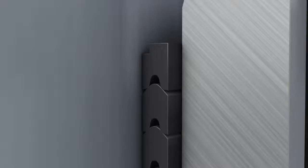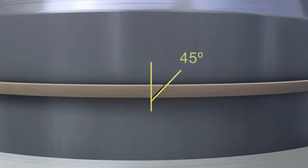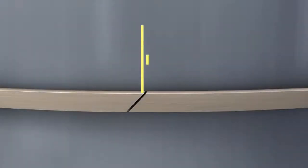The pressure ring is fitted in the same way, and always add the necessary longitudinal allowance in length here as well. If a plastic backup ring is included in the scope of delivery, it must be cut to the appropriate size at an angle of approximately 45 degrees. The cutting clearance should not exceed plus or minus 0.5 millimeters.